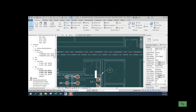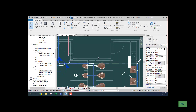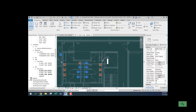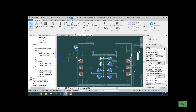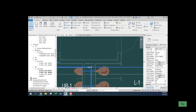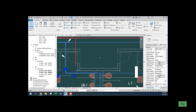Last time I looked at this drawing I was using cold water. So let's route the hot water on the first level. What I'm going to do is route the hot water on the first level, and from the first level I need to rise up in this plumbing chase and supply the seven sinks on the second level. There's only cold water being shown now, so the hot water needs to go up to the second level after I supply the first level.